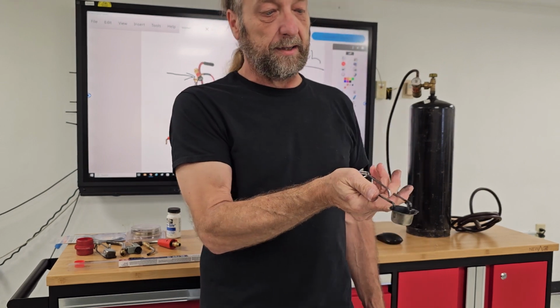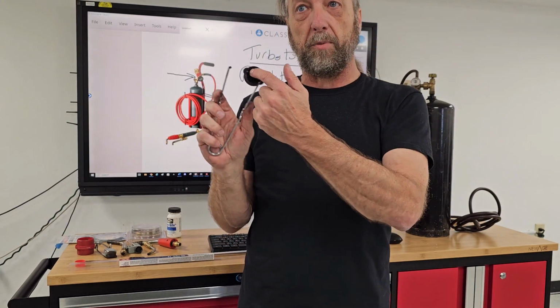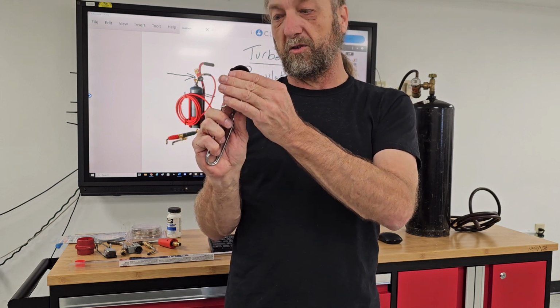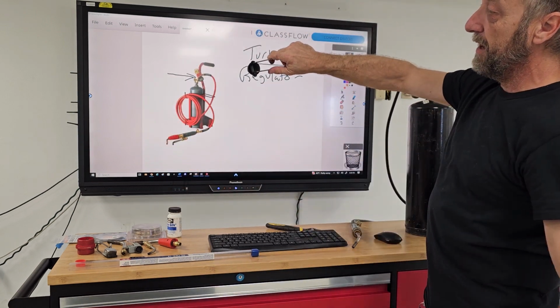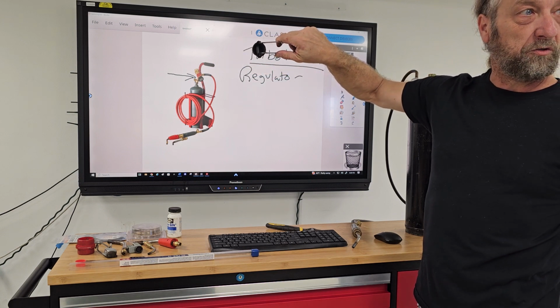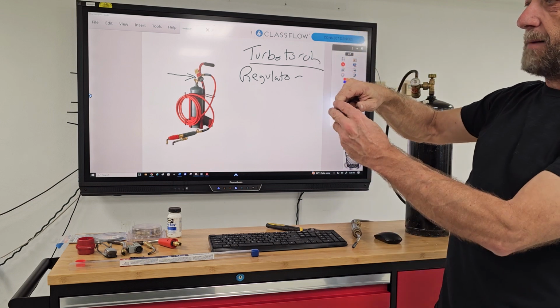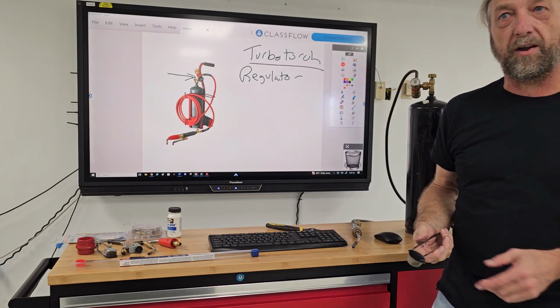But when you're holding it like this, you're pushing this up and away from the part that it rubs against to make the sparks to light it. Hold it with your hand across the top of it, so you're pushing it down into the part. Do you see how many more sparks I'm getting when I'm doing that? If I hold it like this, I'm not creating the sparks that I want.